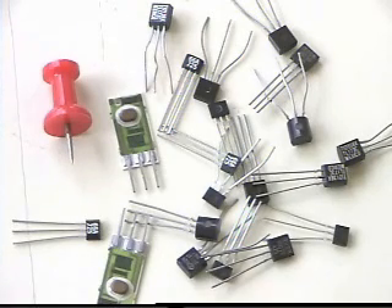The Hall Effect. Pictured here are some typical Hall Effect sensors. They're small, often 3-pin devices that operate from 5 to 30 volts, depending on the manufacturer and ratings. There are actually three types we will be looking at: the Hall Effect switch, which merely switches on and off in the presence of a magnetic field; a Hall Effect latch, that once it latches on, has to have the opposite polarity to cut it off; and the ratiometric, that puts out a voltage proportional to the strength of the magnetic field it's detecting.